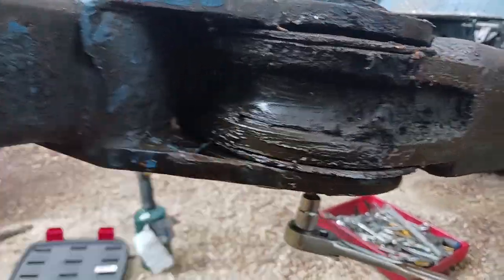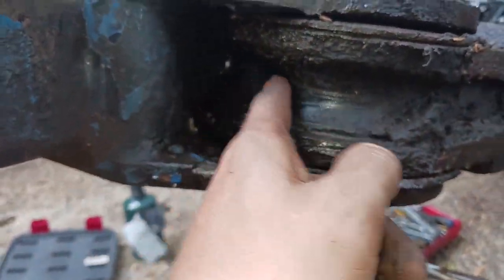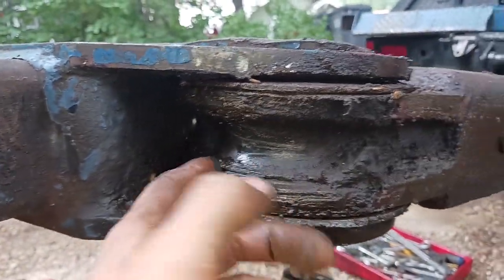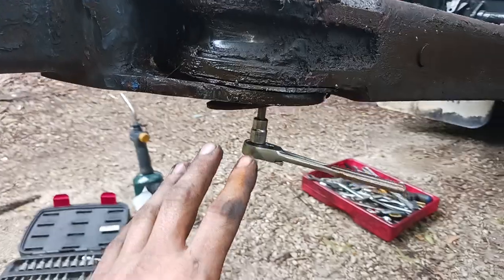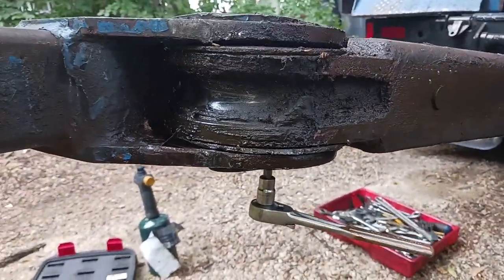Also on this particular style, something people don't really know about is there is supposed to be a ball detent feature that's supposed to keep it straight. It's a little ball detent — we'll see it better when we pull it out. It's supposed to keep it straight, but it gets stuck and worn out, and the spring gets worn over time so it doesn't really work well anymore. That's going to be another good thing to clean out and get going again, so I'm going to drop this out, pound that pin out.